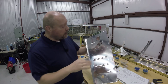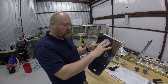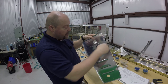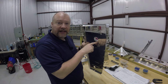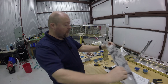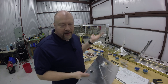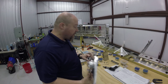It's really subtle, so it's not a big deal, but this rivet in particular got overset — it hit too hard and kind of bent the aluminum on the back. My concern is I'm hoping it doesn't interfere with this piece, which is like the seat belt subassembly. Something goes in here and there's a screw that engages this nut plate, so I'm hoping that slightly overdriven area doesn't interfere. I don't think it will — it's really super subtle. It's not ideal, not what I would have wanted, but oh well. I've got this one done, now I'm going to work on getting the other one done so I'll have both finished.